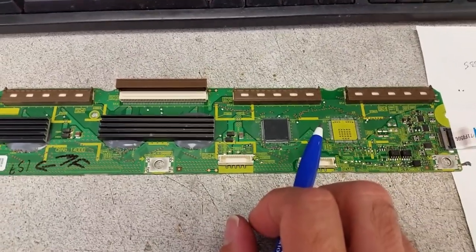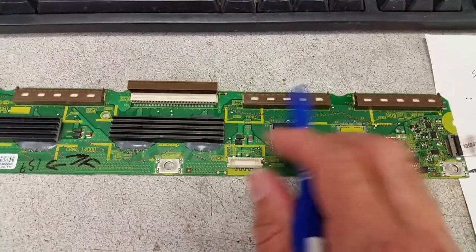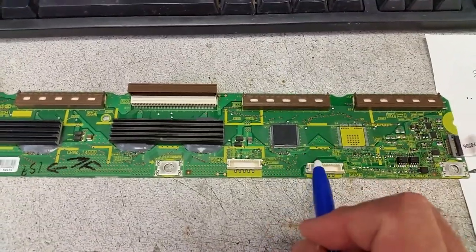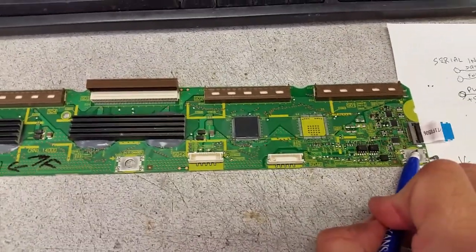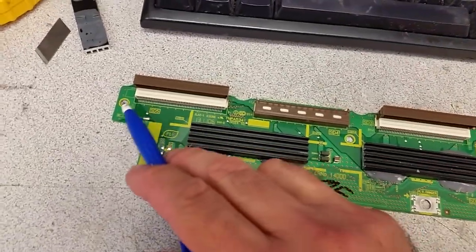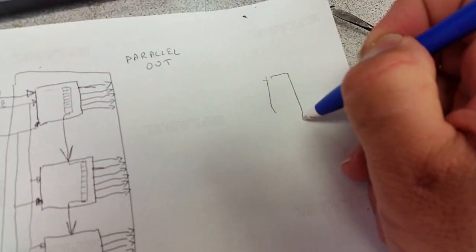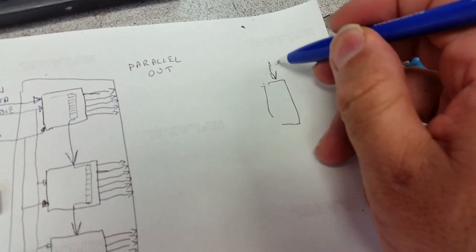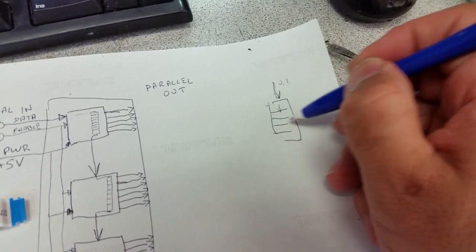That's usually 5 volts. And you have two different sets of voltages. One, again, is the output, and it has its own ground, which varies. And the other is the standard 5 volts, measured to ground, usually, even though that's not the same ground as in the other case. And they're separated. And a shift register is a register that, I will go to the other drawing in a minute, is something that inside flows zeros and ones. And every time it flows zeros and ones, it pushes down the information that is in every individual cell.